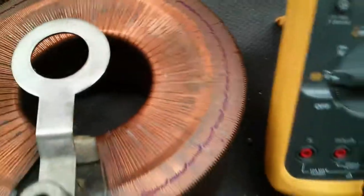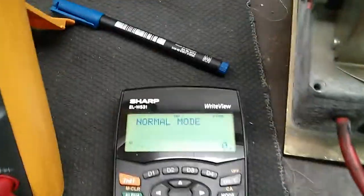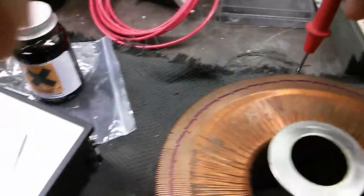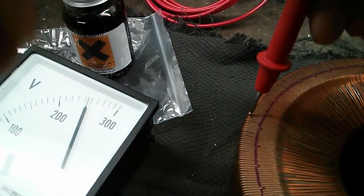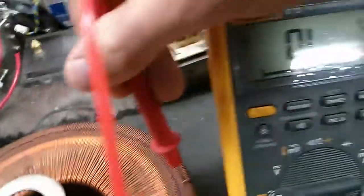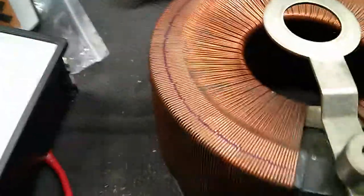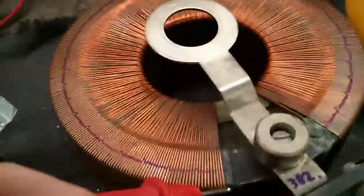50% of the way around just there guys, and 3 quarters of the way around there. So half of 250 - no prizes for guessing - is 125 volts. There you go, 126 thereabouts, so that's good for the input voltage. It varies ever so slightly. So if we go down to a quarter, that should be 62.5 - which is pretty good, that's very close. And then we'll go around to 3 quarters - that should be about 187, 185. So that's pretty good. So we can prove with this now that the voltage is pretty consistent.